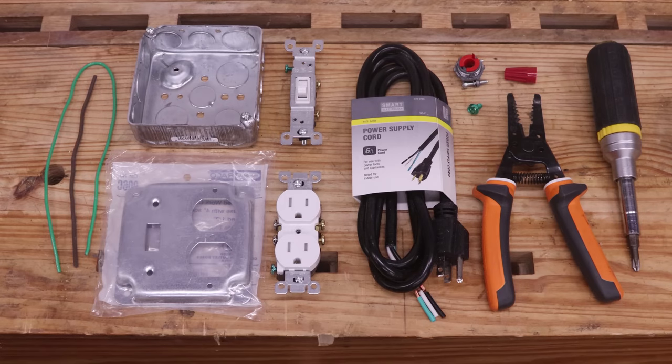The total cost of materials is under $20 if buying everything new, and this is certainly a good candidate for recycling used parts. For the power supply, you'll need a 4-inch by 4-inch metal junction box. Ideally, you want one with a raised dimple inside for a grounding screw. Exposed work cover with slots for a switch and a duplex receptacle. A switch, a duplex receptacle or outlet, 14-gauge power supply cord, make sure it has a ground,